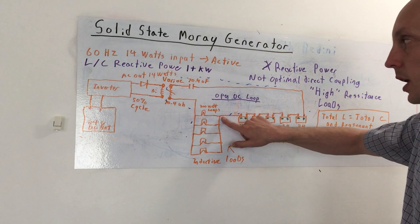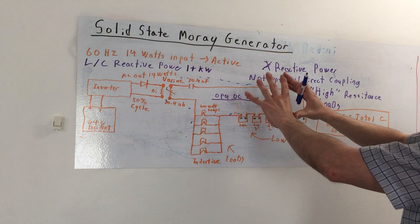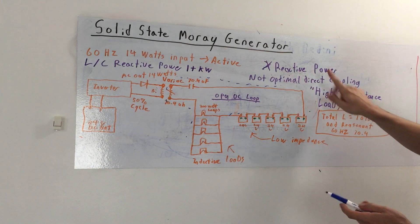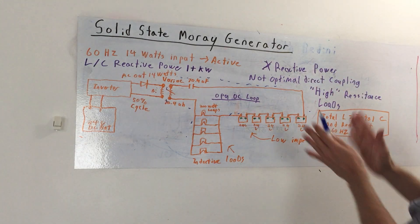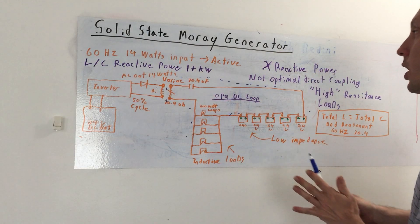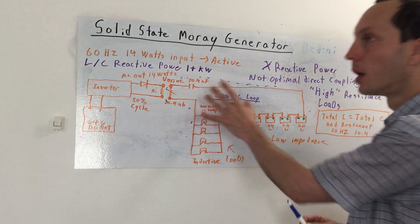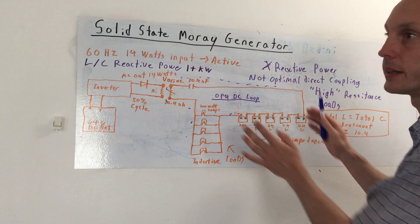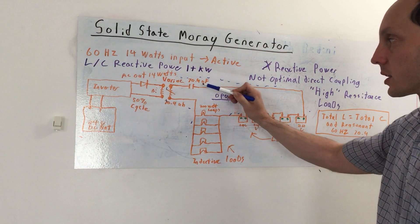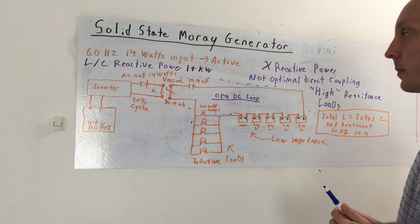What's interesting is they're not tapping externally — they're actually part of the LC loop. You can run things in the LC circuit, folks. A lot of people forget, as long as it's an inductive load. It's not as soon as you start adding a lot of resistance or tapping into it — this is where you get into trouble. So it's not optimal for resistive loads, but inductive loads will become part of that LC circuit. It's relatively easy to tune. So between the lamps as inductive load and the variac, with a little fine tuning, we get our maximum displacement current.